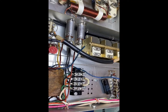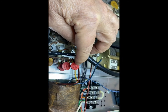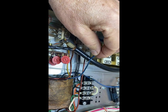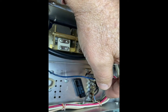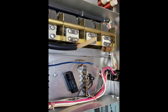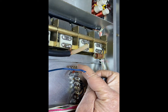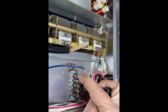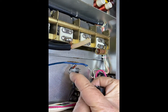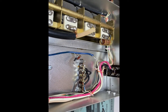Okay, the first two instructions were to disconnect the wire here from the meter board. This wire right here was just going to ground over here anyway, but you got to make sure that it stays as long as possible. And then disconnect the other one over here from these terminal strips. The capacitor is removed too, and this little strip is removed completely. And you make sure that this is nice and clean, and this is clean because it's going to connect to the board. So that's the first part of it. I have to remove that now, but that's next. So far so good.